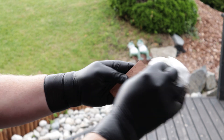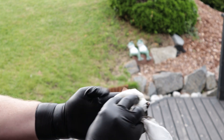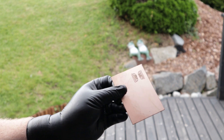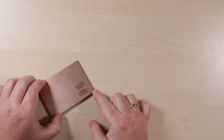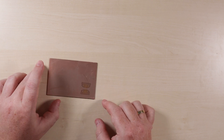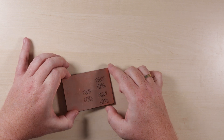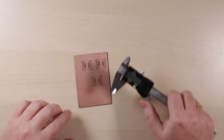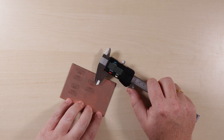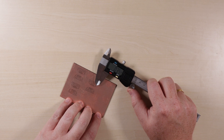Remember to always wear the appropriate protective gear when working with lasers and etchants. This is the final result of the PCB. We also made a PCB with even thinner traces. This requires you to focus the laser and not burn off too much paint. We had the laser running at only 40% power, and that gave us lines that were about 0.4 mm thick.